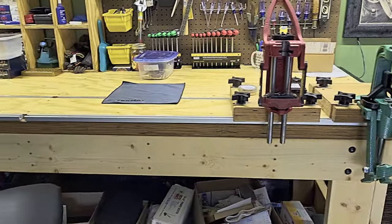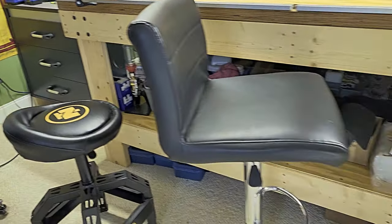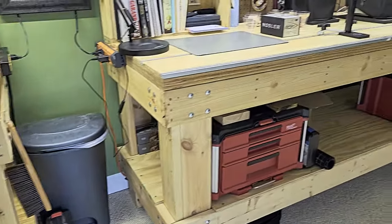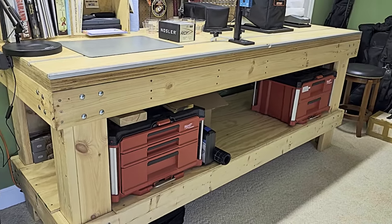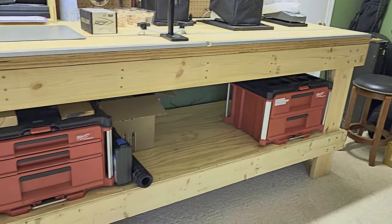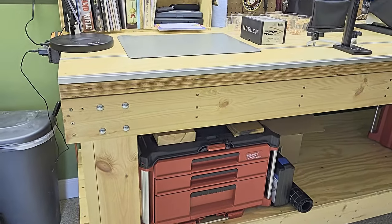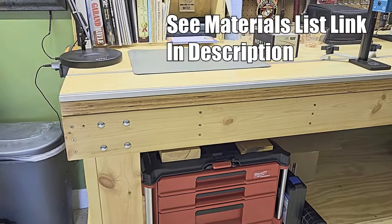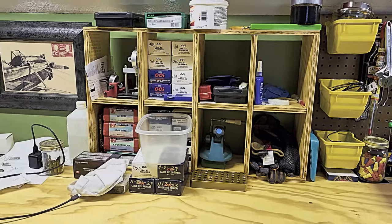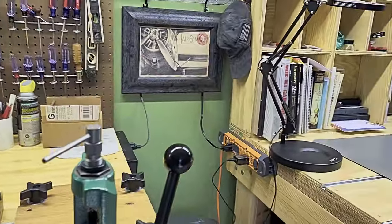If you haven't watched my video on how I created my perfect reloading area, you need to do yourself a favor and go check it out. Long story short, that's the bulk of the perfect reloading area. How does that get perfecter? Well, it was so dang good — you build an identical bench with a few modifications. This bench is eight feet long, 32 inches deep, and I think it's 39 and a half inches high. I'm going to share a materials list for this one since I've had a lot of requests. The cubby hole storage area on the original is put to great use — things fit in there almost perfect — but I didn't feel like I needed the exact same thing over here.